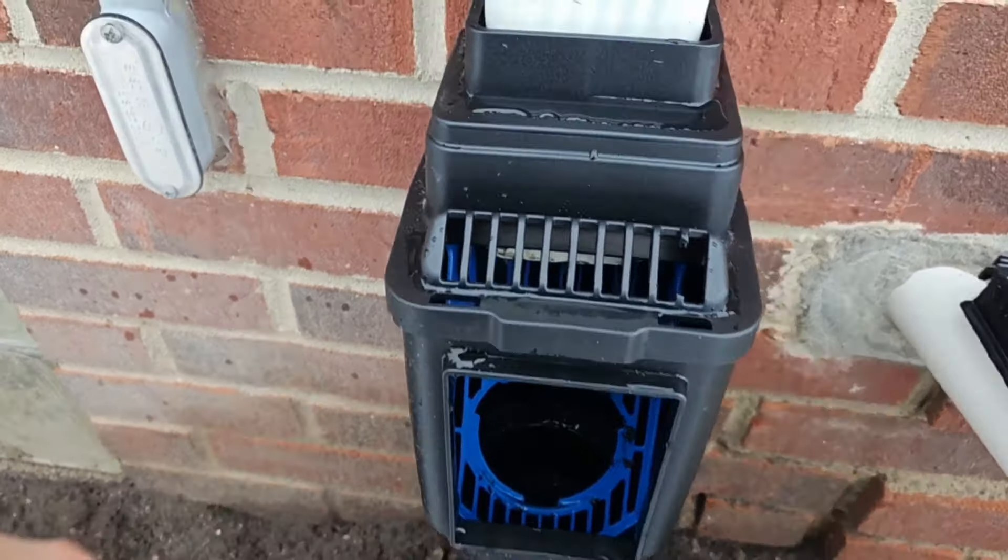I'll put a piece of our super sticky, super stretchy plumbing tape over this. It's going to lock in the heat and not let all the heat escape — really important. I want the heat to rise and kind of help prevent the metal downspout from freezing up at the end, because I don't have heat cable running through this. Not worried about it here. But if it was an issue, I would run heat cable through there. Follow the directions when using heat cable.